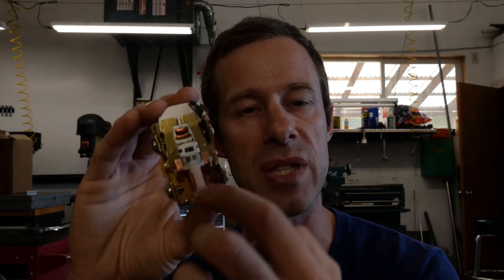That's an integrated circuit term. Amplifiers are a very common, very inexpensive circuit, but they can amplify that difference enough to activate this coil down here, which is the click that you hear when you test the GFCI, and it disengages.